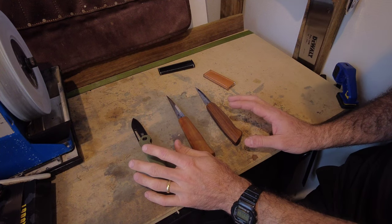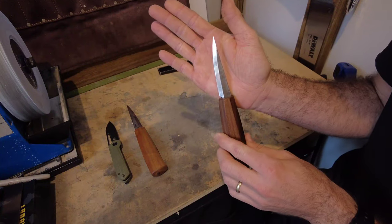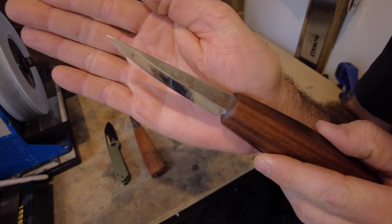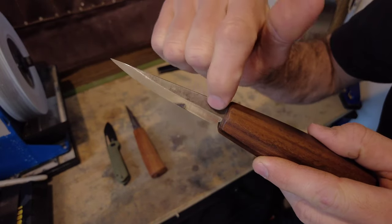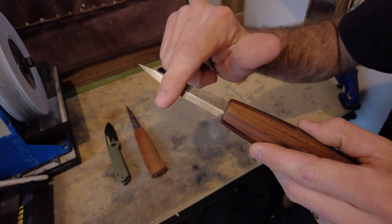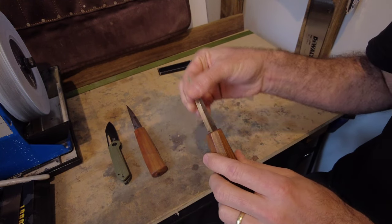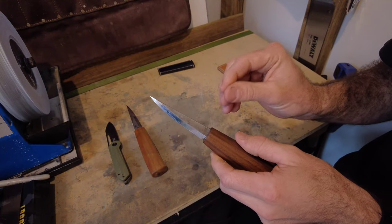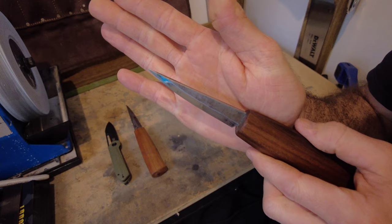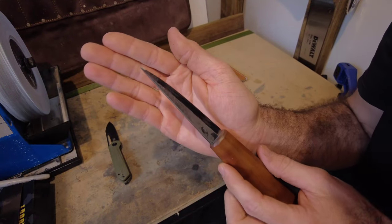These have three different grinds; two of them are fantastic for woodworking and green woodworking, this one not so much — let's describe why. First off, let's talk about this Tamarkin custom knife. This is what you would call a Scandi grind. What that means is the bevel — you can see if I bring it up a little closer — the bevel runs right from the back section all the way to a zero point, to an apex. There's no change in the bevel; it's completely flat.